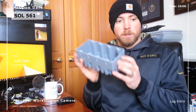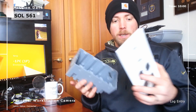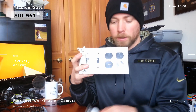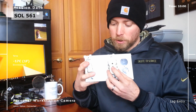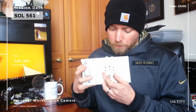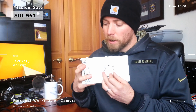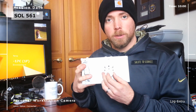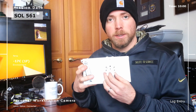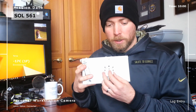What we're going to do today is build a project box for the heating and ventilation system. We're going to have a switch and a power plug — the switch will control an individual power plug, and on each plug there'll be the circulation fan and the heater we just installed. The switch is here as an emergency shutoff, so if something goes wrong you can come over, flip the switch, and bypass any automation inside — killing power to both units.